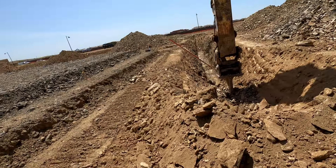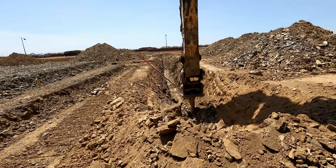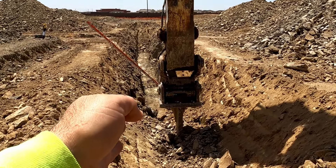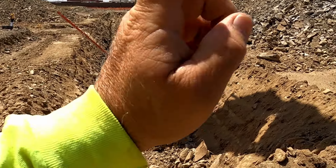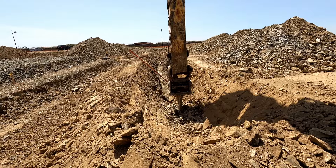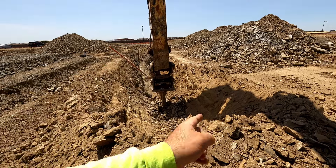Just keep in mind, you've got to keep track of all your stuff when you get off the machine. Check everything — check your pins, make sure all your bolts are good, nothing's broken off, check welds. Quick Connect is a big one. You can see just above where the Quick Connect is grabbing onto the pins — the cross pins — where it reduces in. Right along that area on this side, that's where you typically will get a crack develop. It'll crack right in those areas.